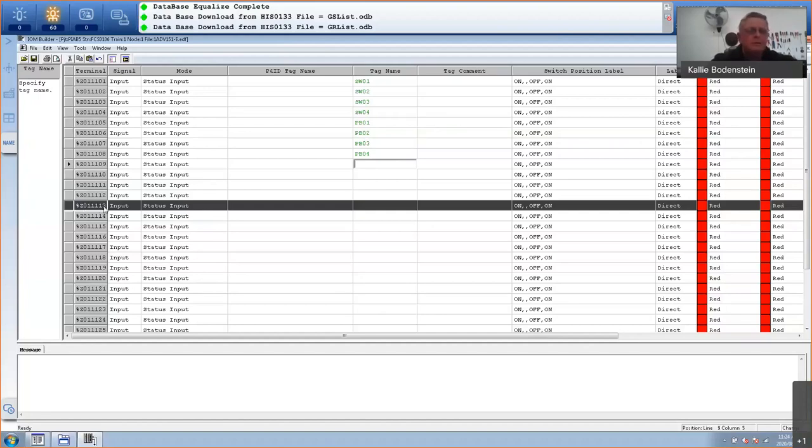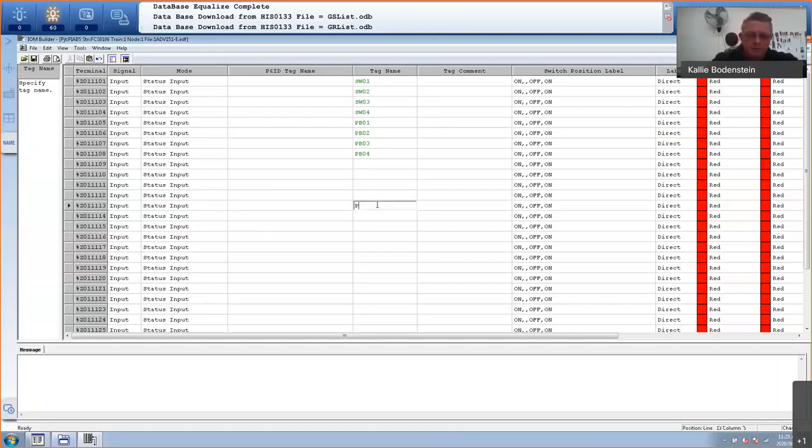So this is an absolute address. Basically, %Z01 means node number one, slot number one. This depends on the module, but on an analog card it basically varies between 4 to 20 milliamps and HART signal. In digital, that will always be a 1. This is channel number 13. So you can either use the absolute address or you can use your tag name. I'm just going to say here, this will be pump 1 feedback. And then on channel number 14, I've got pump 2 feedback. These are the feedback signals from the pumps.